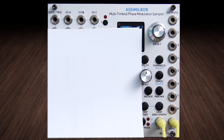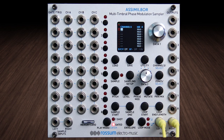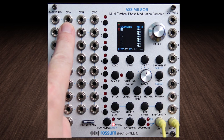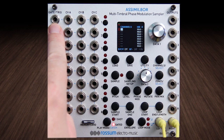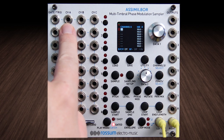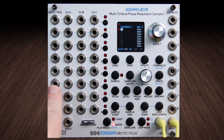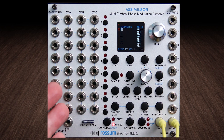Let's just break it down — just look at one channel. You've got a gate, you've got three CV options assignable for each channel. Yes, there are eight channels, but the beauty of this matrix is that you can assign anything to anywhere and call on it again in another channel. For example, say you were using this gate to trigger a sample and you had CV-A assigned for pitch data for one volt per octave — if you wanted to mirror that down on channel six, you could just call on that assignment through this matrix.